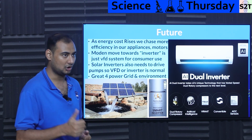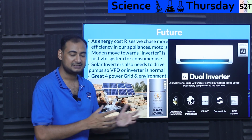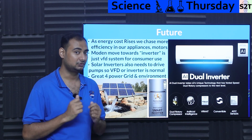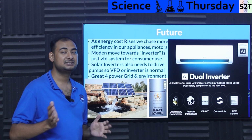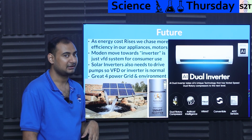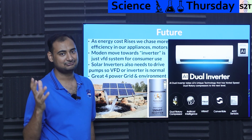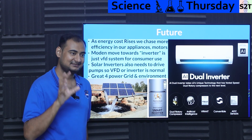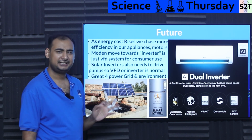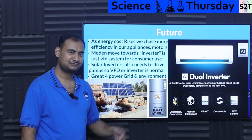Power factor correction, awesome. Not having surge, your transformer lasting much longer, really good. Less wasted heat, really good. And again, coils lasting longer, really good. So everybody wins once we start to deploy this technology. The only complication is that it's far more complex. So while the motor could now last much longer, the chances are the board could poop out before that.